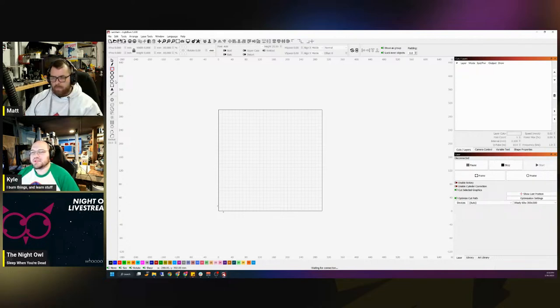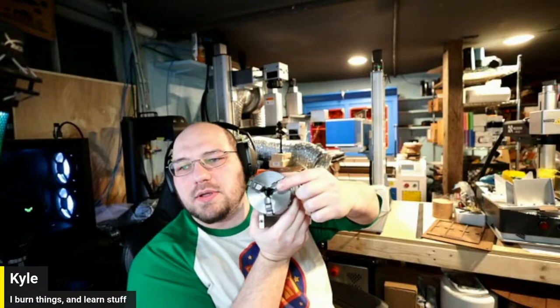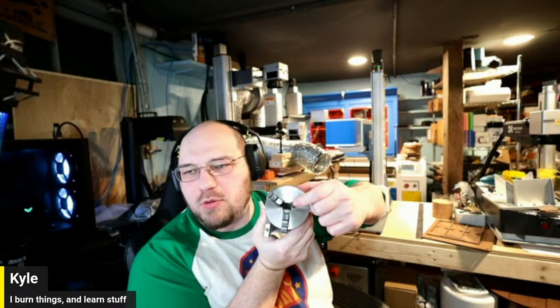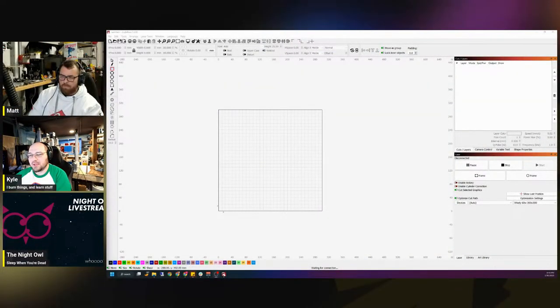We're going to duplicate it into a circular pattern of three. What if people have pins instead of teeth? In principle it works the same way. Looking at it here — you can see it's actually not square on the inside, it's kind of like an arrow tip pointing in like a triangle toward the center. I'm literally going to square it off to make it as simple as possible. It's irrelevant what the middle of the design looks like because we're pinching it going outwards — and the outward side is flat.